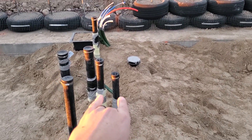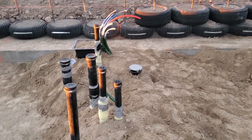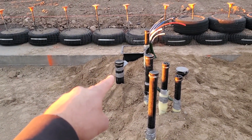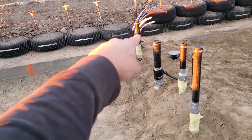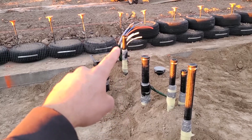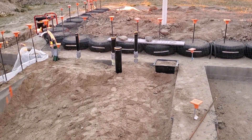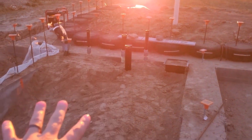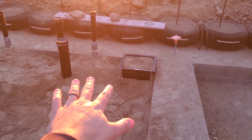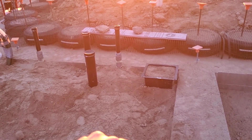We've got two pipes for drain — one goes to black water, the other goes to gray water. I'll talk more about the gray water system soon. That's the drain for the toilet, and the gray water drain for the shower and bath. We'll get that all tied in there. Same with the lavatory. Here's bathroom number two, in the kind of greenhouse area off the side. Over here we'll have a tub and shower kind of thing, and the drain for that area.